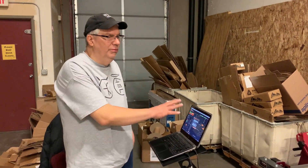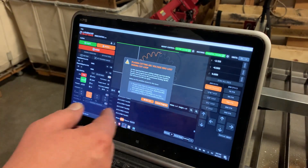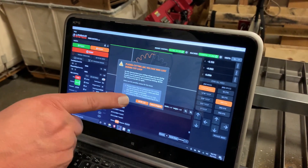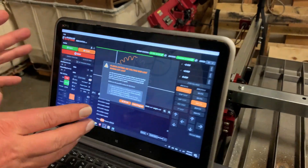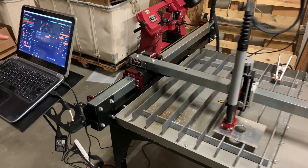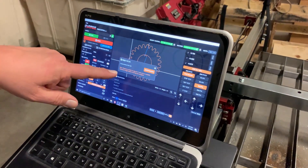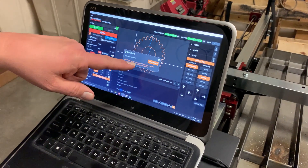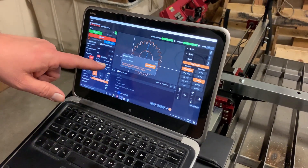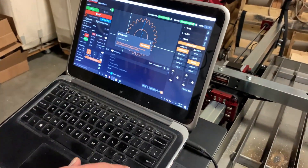I've got the breaker turned back on again and we're going to show you the screen. I didn't touch anything on this side. This is the dialog box — it gives you some tips and possible causes. I'm going to hit retry cut, which I'm not sure what it does, but we're going to try it. It says: run from loop starts at line 34. Please be certain to jog your machine up to a suitable clearance height before running your program. So let's jog it up.